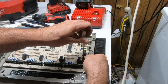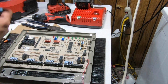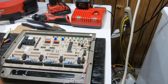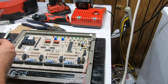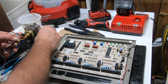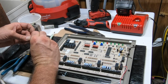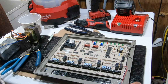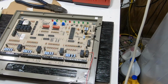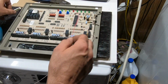As far as my jumpers I'm going to make, they don't have to be an extra foot and a half long, but these two wires do. It doesn't matter on this transformer if blue or yellow is the hot wire. It doesn't matter because if one side's grounded, that's the only way polarity matters on this. Both legs of the power of the transformer are going to be about 12 to 13 volts. So it makes no difference. I probably should cut that bare copper off right there because right on the 24 volt red wire is a little shining bare copper. So let me pull that, cut that. I don't need to create any sparks.